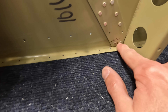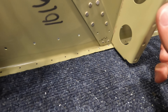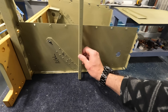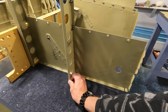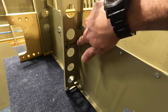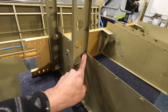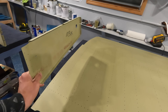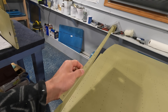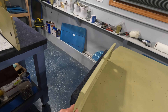The shop head is on the inboard side, I would imagine because it would interfere with the lower flange of this 1016 outboard seat rib. These are the intercostals — you have to dimple the outside flange and the inboard flange, and there's a spacer in between the rib and this intercostal, along with these three nutplates. They're different. When you flute these ribs, this flange here, you have to do a pretty heavy fluting job because it kind of curves around and matches the skin.